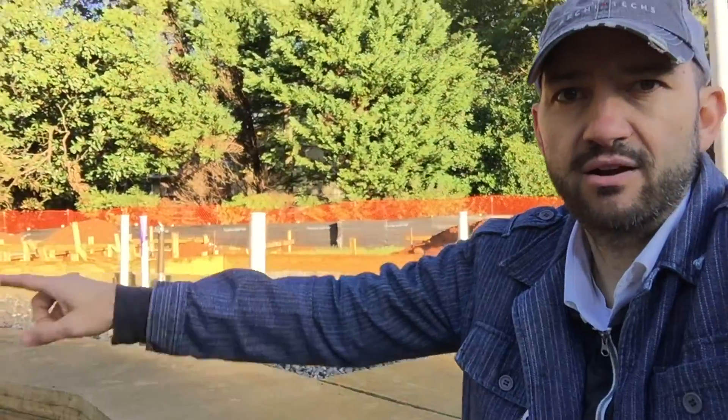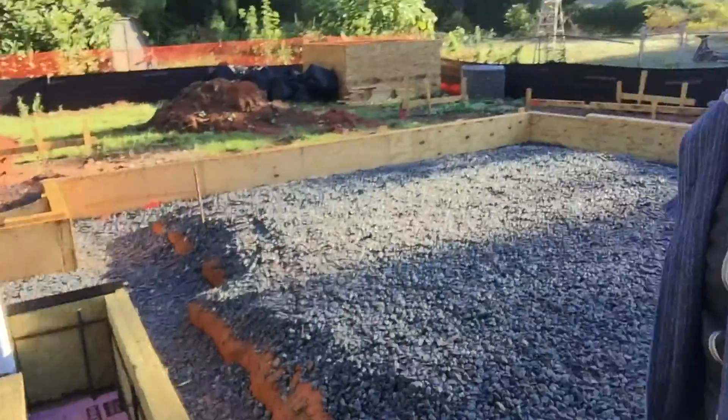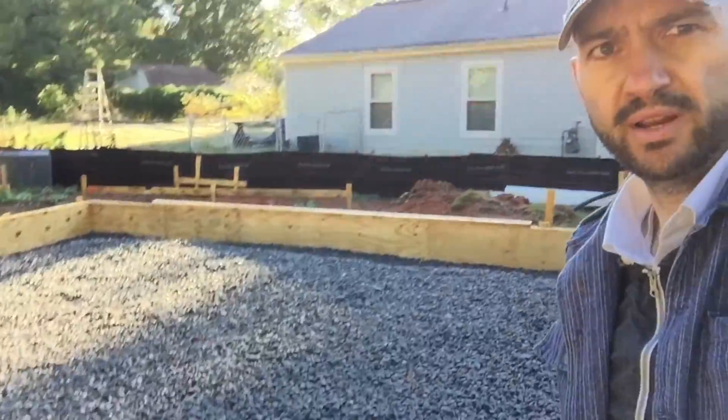This is the same detail around the entire perimeter of the conditioned portion of the house. I'm sitting here next to the garage — it is not insulated underneath the slab, but it is going to be insulated with two inches of rock wool on the outside.